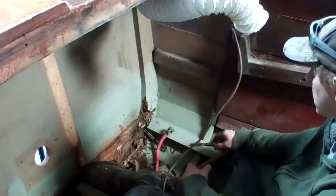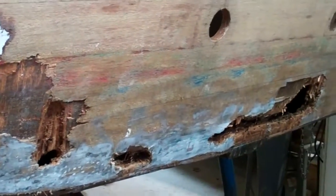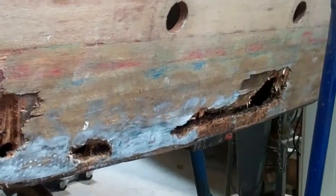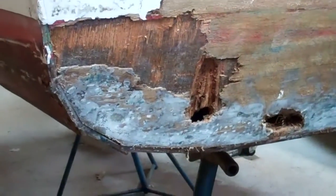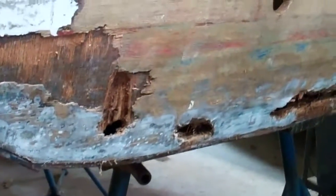This side is the same way. Once we get to the bottom planking, the bottom planks are all okay. What I believe happened is the water had no way to really escape out the back, so water sat back there and that board sucked up all the water, which bled through into the transom. I rest my case for not fiberglassing wooden boats, particularly in the manner that this was fiberglassed. Wrapping fiberglass around the lower edge of a transom onto the bottom planking is just a fool's errand and destined for failure.